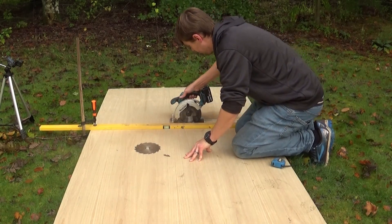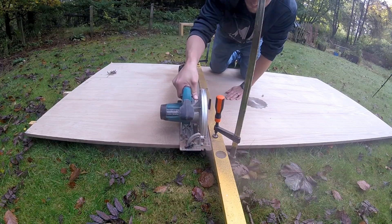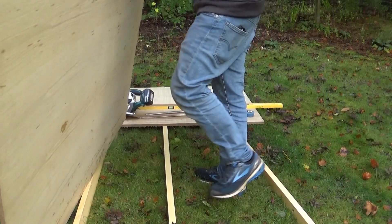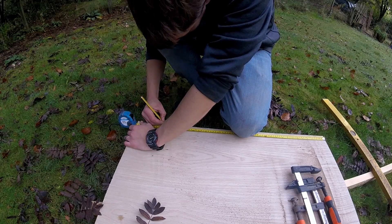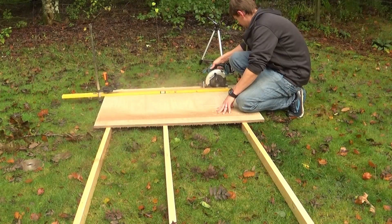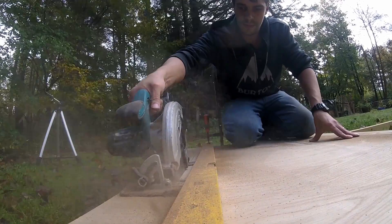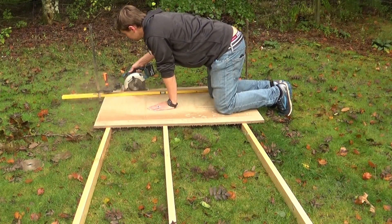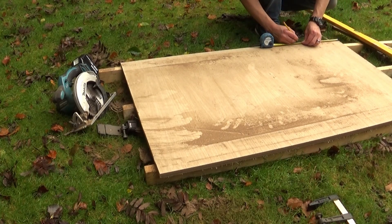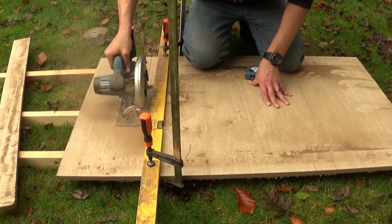The very smart people will have noticed I made a mistake straight away, and what I did wrong took me over a week and a completely other job before I could work out what I'd done wrong. I was genuinely thinking my batteries were knackered — it's a new saw blade, there can't be nothing on that. Turns out I can't figure out the right way to put the blade on; it was the wrong way around. It made really bad edging, it burst out so much on the back end. I'm able to hide it for this project because it's for me.